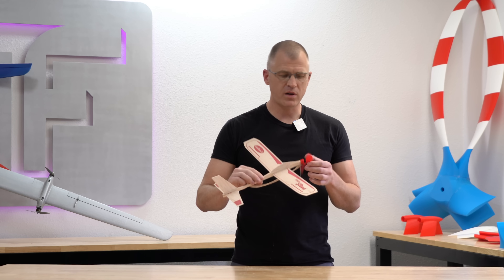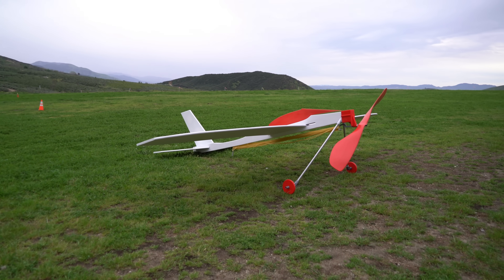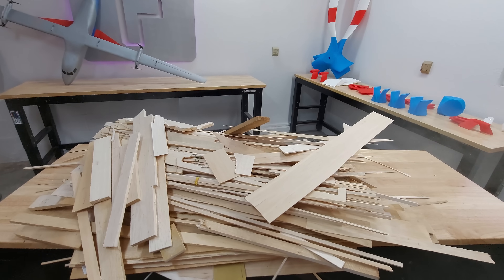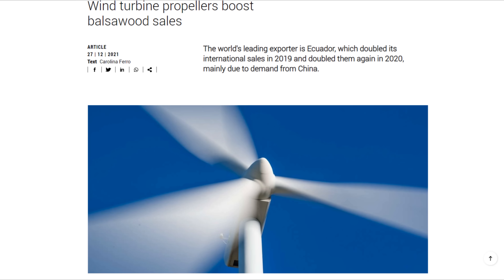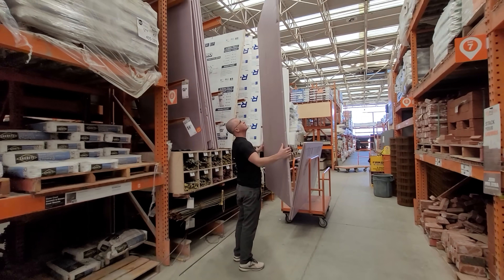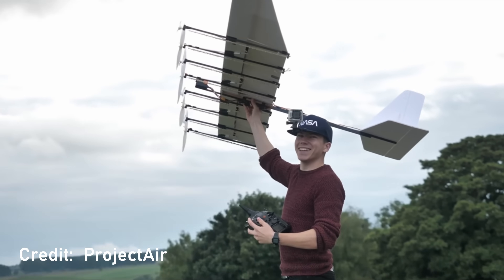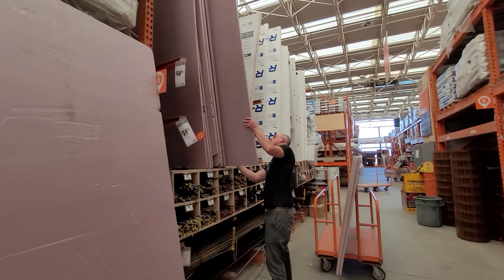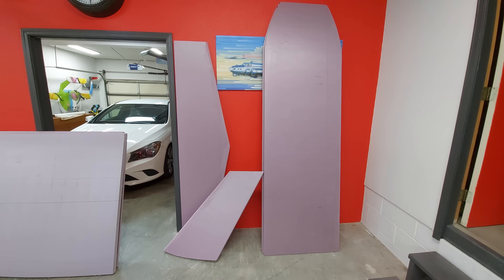These simple models have sparked the interest in aviation for countless kids, both young and old. The thought was to scale this model up and construct it just like the original. Making this out of solid balsa wood wasn't going to work as that would break this channel's budget for the next ten years. Balsa wood prices are very high right now due to its extensive use in modern windmill blade construction. However, my local hardware store has these eight-foot sheets of very lightweight insulation foam at a fraction of the price. An eight-foot wingspan would not break Project Air's recent world record of 11 feet, but two sheets would, and that is how the wingspan came to be 16 feet.